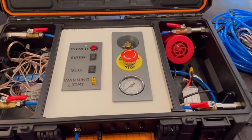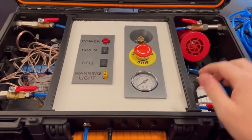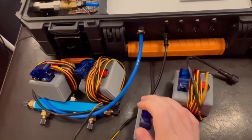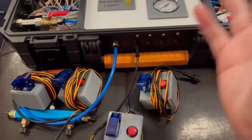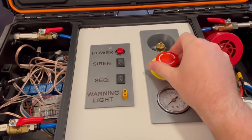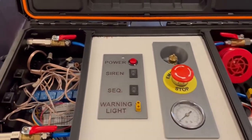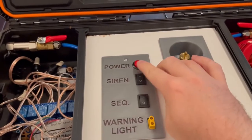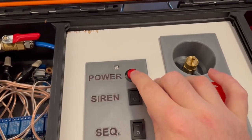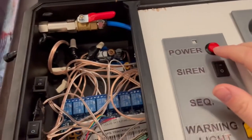What do you do if the launcher turns itself off? That probably means the battery is too low. If it stops responding to all input and seems like it turned itself off, double check the safety switch. Make sure that if you twist that over, it's off. If you press and hold the power switch it should turn blue, but if it flashes yellow afterwards that means the battery is too low and you'll hear it click itself off.